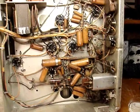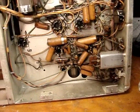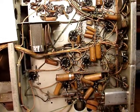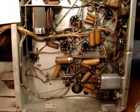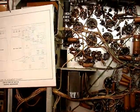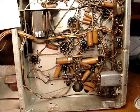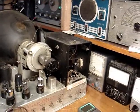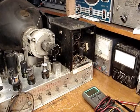I've got to get the right service information for this chassis, and I don't know where I'll ever find that. It's not listed in the SAMS catalog. I think I'd have to try to find an OEM service manual for the Magnavox Embassy, and on eBay I haven't found it. I've aborted my plan to do a slow power-up of this set because I don't have the right service information. One thing I did notice is this fuse in the horizontal circuit is open.